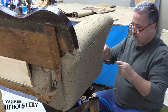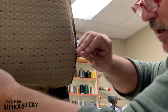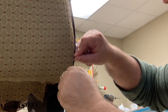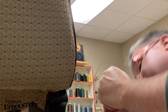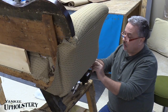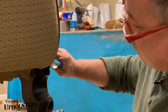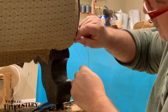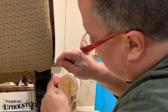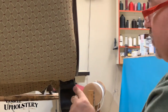When you put on the dust cover, it'll hide the black — that's called cambric. That goes on last. It'll cover up anything in there, especially with the old type springs like this. As the contents would break down — the cotton and all that — the cambric dust cover would keep it from going on the floor, and grandma wouldn't be going ballistic trying to sweep it up all the time. That's the burlap — it helps keeping that finely woven. The stuff that goes on top is strong and covers the big gaps.